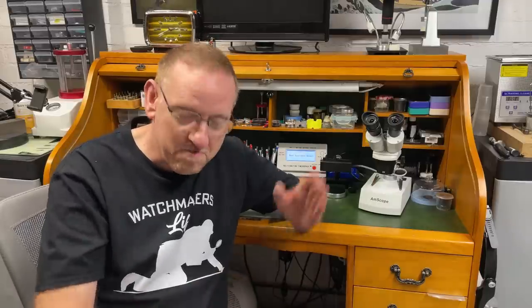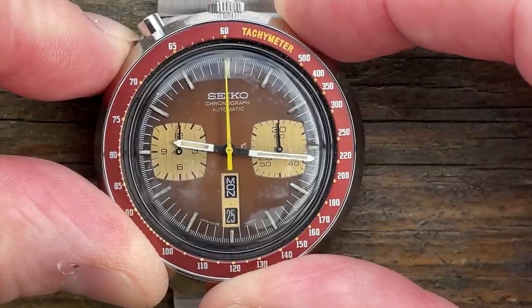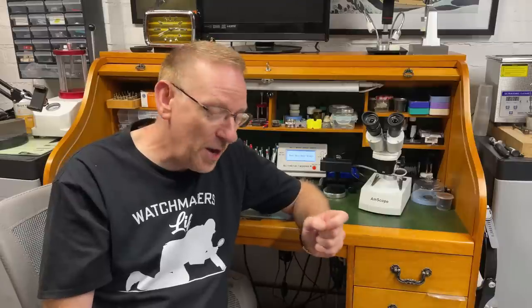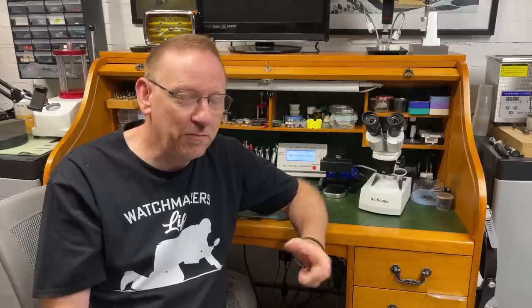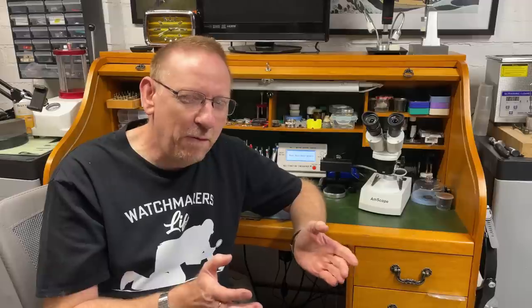So it isn't completely 100% working and in order. The first problem is the hour recording hand, I suppose, or that whole mechanism creeps. When the chronograph is stopped, it still wants to run, and it's not running like the chrono would be running. The brake is clearly touching the wheel, but not enough. I think it crept about 4 or 5 hours over a 12 hour period.